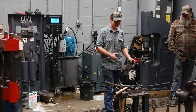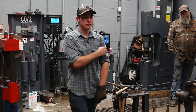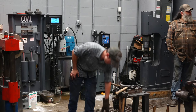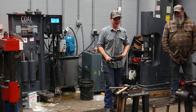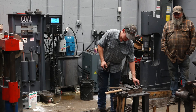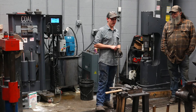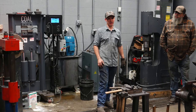They don't have to look at it and say, I think that looks right, or I think that doesn't look right. It's repeatable. How much variation do you allow for people not hitting hard enough? Depending upon how hard your striker hits, the hammer is going to look different, obviously. This particular sequence is what we use in group classes, and you have people hitting from not hard enough to okay, and all the hammers turn out okay. They all look different, but they all turn out okay.